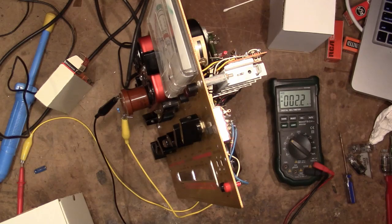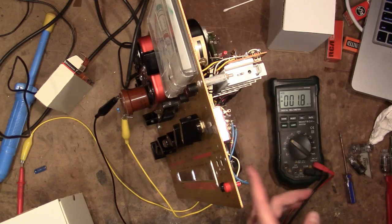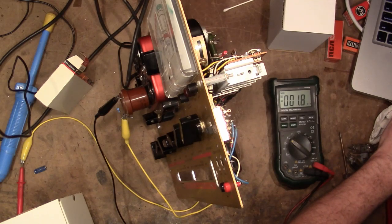That's entirely dependent on the earlier calibration and the health of your 83 tube. And I know I got a new old stock 83 and I went through and calibrated that. In the documentation here it says that if you're within 150 to 153 or 150 to 155, you're alright.